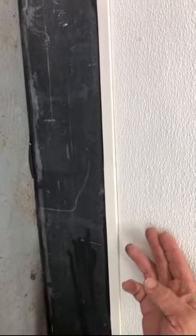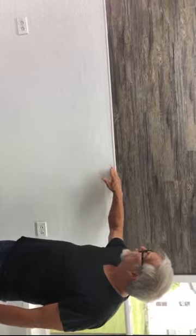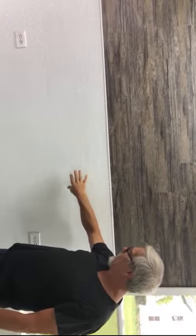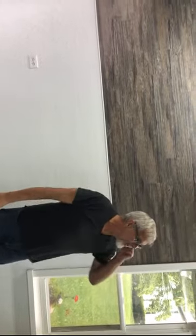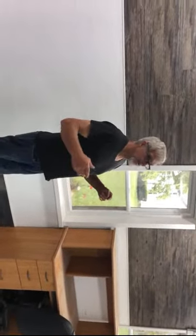The FRP board goes up and over and back behind the plywood. We have OSB and then we glued this FRP board, which is kind of a restaurant kitchen kind of material. On top I used stick-down flooring applied with the same FRP glue. When we tried to just stick it on the OSB board, it just fell off. This will be a good experiment because there will be a lot of temperature changes in here, and if it works, it's going to be really nice - quail just get amazingly dirty, and we wanted this to be super clean.